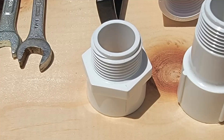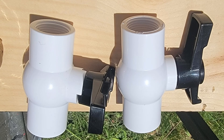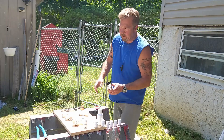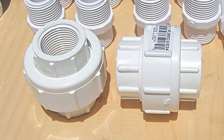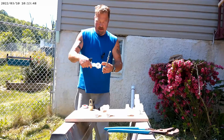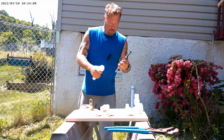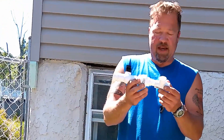I'm going to use this three-quarter inch adapter — three-quarter inch threaded with a slip on the end. The drive pipe usually fits in there snug enough that you don't actually have to worry about gluing. This is going to go into one side of one of our two shutoffs. We have our drive pipe end already put on this shutoff, and we'll put on another connector. From our connector, we're going to go to our first union. The unions are getting put on just to make servicing the pump down the road easier — I could shut the water off, disconnect at the union, and take the pump right off.